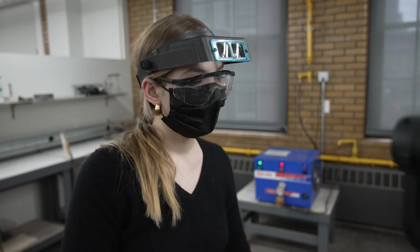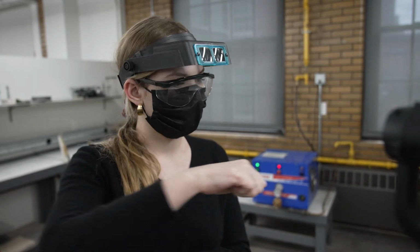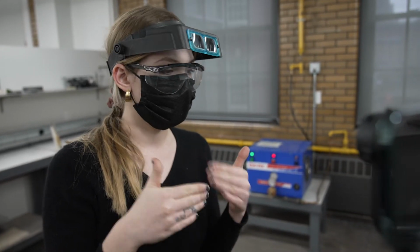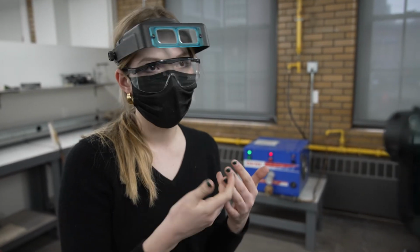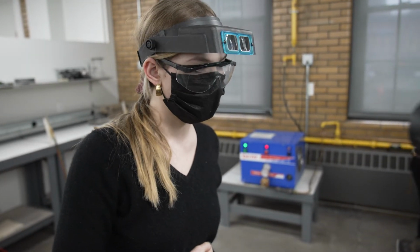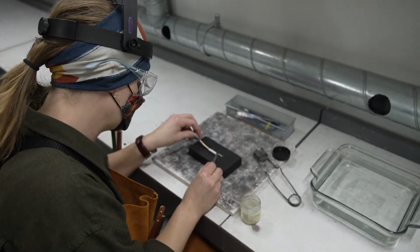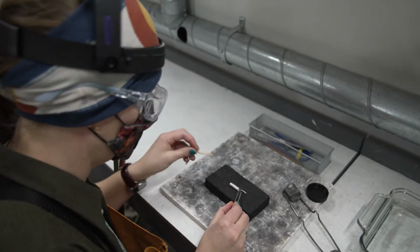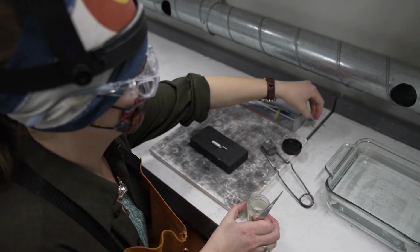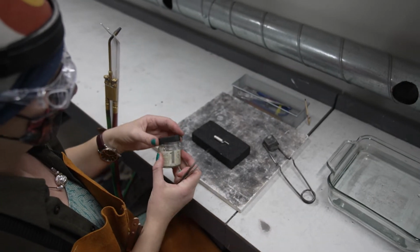So with this, instead of with just a regular wire, we don't want to heat directly on top of it, because we want every single one of those jump rings to get heat in the center, on the outside, everywhere. So Audrey is going to heat on the charcoal block and around the coil. That'll make sure that every single bit of this gets annealed, because the worst thing is when you have half of it annealed and half of it work hardened.